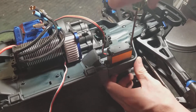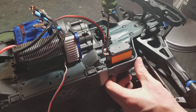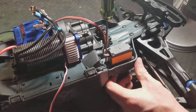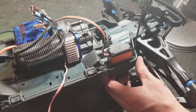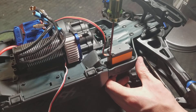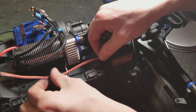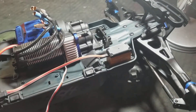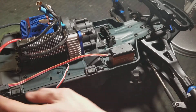I recommend doing this by hand — do not use a power tool, you don't need a drill or anything. Sometimes it fights you, sometimes they go right in. Work the screws all evenly, get the rubber grommets seated, and then you've got enough room to stick the wire into your receiver box. That's the quick install.